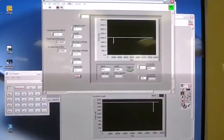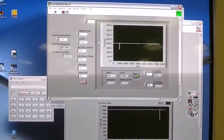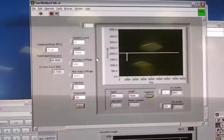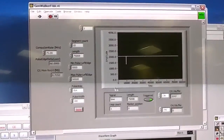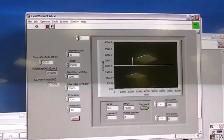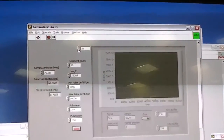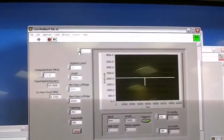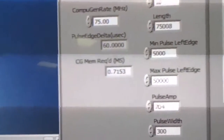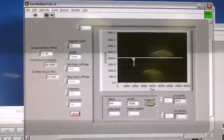In order to demonstrate the repetitive acquisition capability of the Octopus card, I'm going to generate a very specialized waveform. What I've got here is a little waveform that changes on every trigger — it changes polarity, as you can see. It also jumps by 60 microseconds from one trigger to the next. Remember that number, because I'll show it to you in a second.